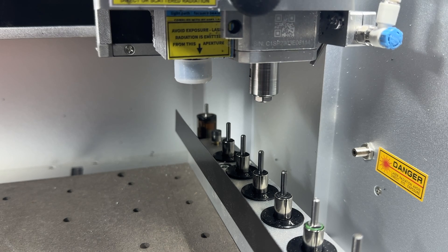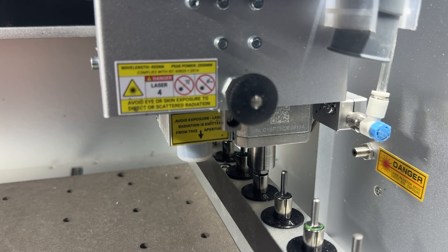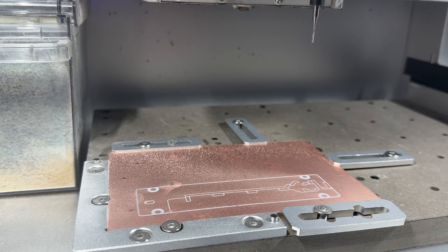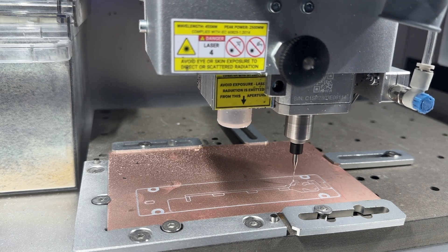The shaft diameter determines the overall diameter of the shaft which fits into our CNC machines. You must ensure that you select bits which fit within the collet of your CNC, and the Carvera can be equipped with bit collets from 3.175 millimeters through 6.35 millimeters in diameter, or for bits that are one-eighth to one-quarter inches.